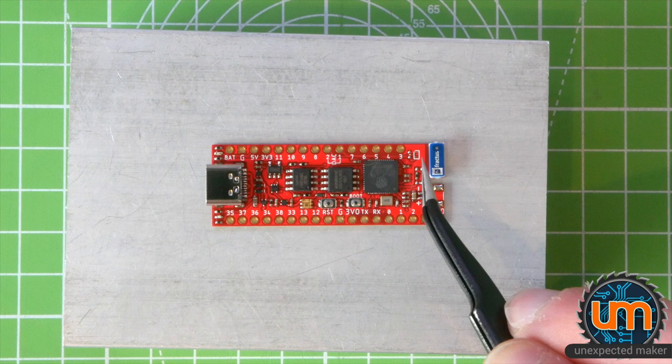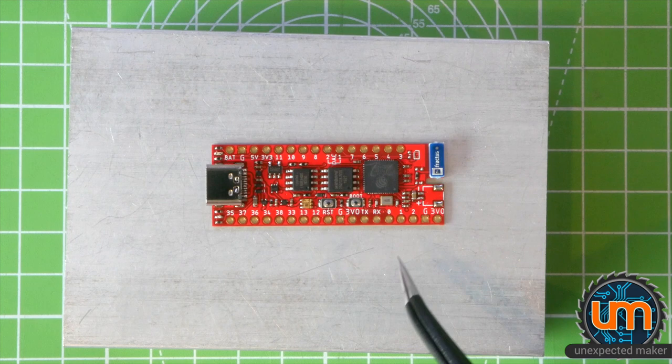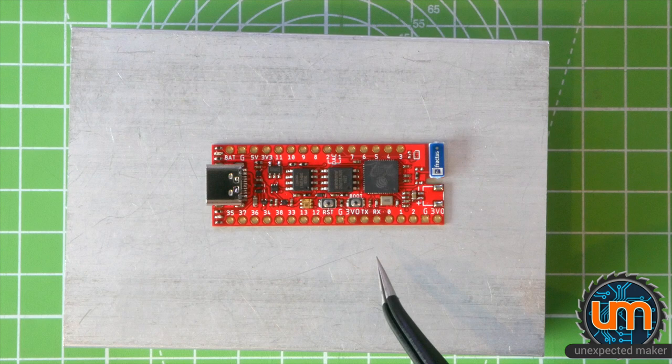It's going to give you a much more accurate RTC clock over longer periods of time, but the actual MEMS crystals are quite expensive, up to like $5 or $7 each. So I wasn't going to be including one on the board by default when 99% of the people won't need one. I did forget to mark these pads here as no paste.